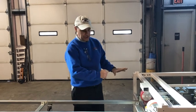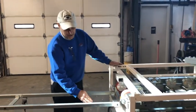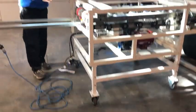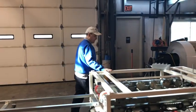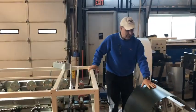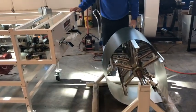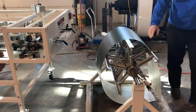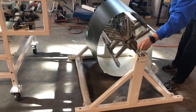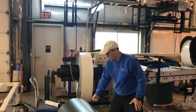This machine is on our warehouse stand. The warehouse stand, which is the lower part with the wheels, does not come with the SS4E. You can also get a variety of coil handling options. This is our expandable arbor reel that you can mount any coil on — you can expand it in and out and then put the brake on for ease of use when you run your machine.